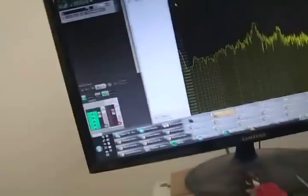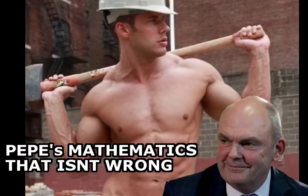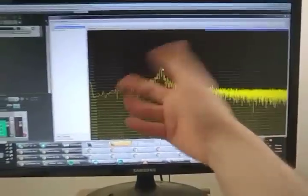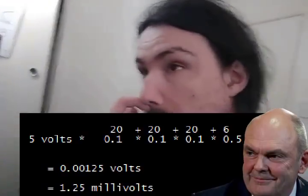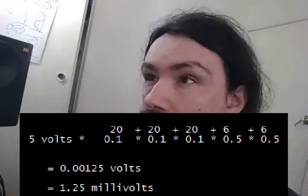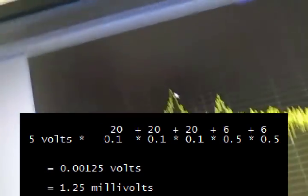How do you translate negative 72 decibels to a voltage? Get your multimeter, plunk it onto there, and let's say it's five volts. That's going to be 72 decibels below five volts, which you can work out on your calculator. A good rule of thumb is that every 6 dB it halves the signal, or every 20 dB it goes down 10 times. Logarithmic scale, yada yada.